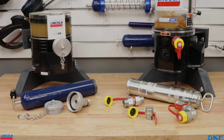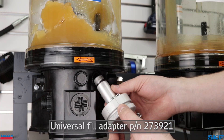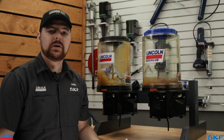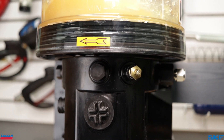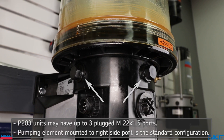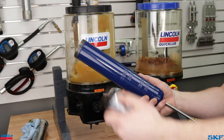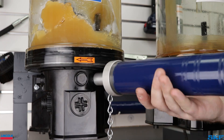Stepping up, the next fill method involves adapters and cartridge loaders. The universal fill adapter and the manual filling pump adapters permanently attach to one of the metric M22 x 1.5 threaded ports. Concerning the P203 units, earlier versions were equipped with the fitting directly mounted to the body, while current units were updated using an adapter. If yours is one of these earlier models, utilize one of the extra pumping element ports as a means to attach the filling adapters. The universal fill adapter requires a standard grease gun tube assembly which threads onto the larger end so the grease from the cartridge can be driven into the reservoir.